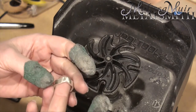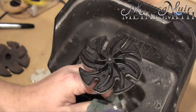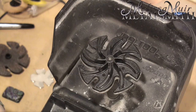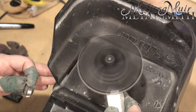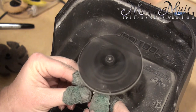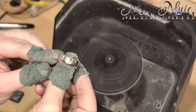Make sure everything is nice and even, and from here we're ready to give it the final high polish finish. We'll do that with our felt. You can see my felt is actually very well worn with a lot of silver in it - that's totally fine. If you ever need to clean it out, you can run it and take a regular sandpaper one against it just to make sure it's softened up and doesn't have too much buildup. I'm going to run this at high speed. Never use water with this compressed felt - we are going to use Ani's compound. I like to load this up, especially when doing a ring and taking it to that high gloss finish. Give it a nice bit of pressure. You should be able to easily see that polish come up. And at this point, that is a mirror finish - it's that fast.